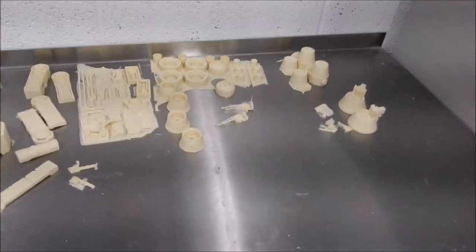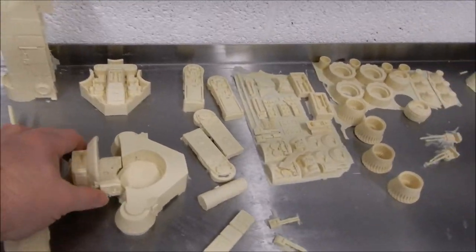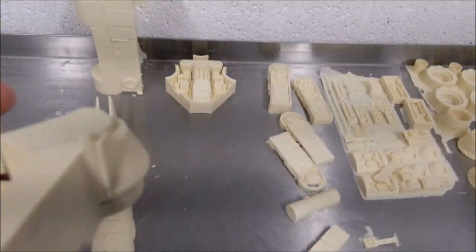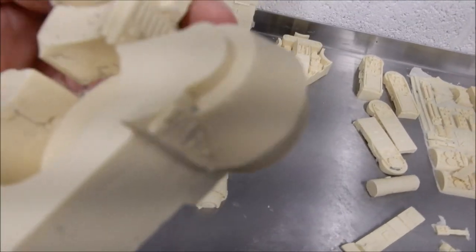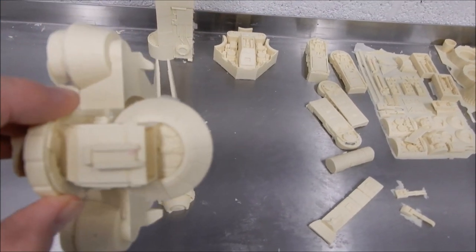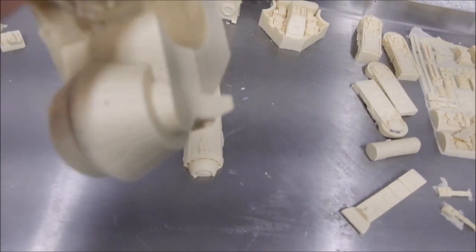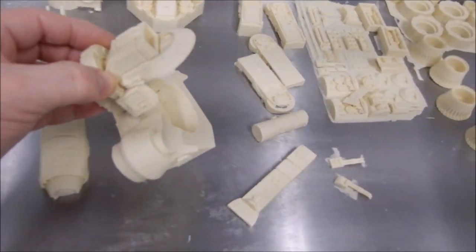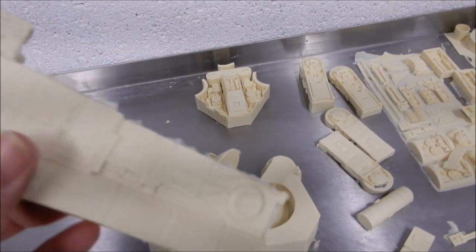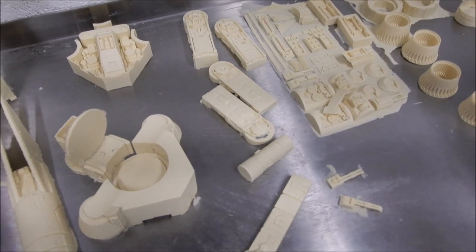Well, it doesn't look like much right now. One of the first castings of the hammerhead, and they came out pretty good. A little flashing on it as usual. These look a little dirty because what usually happens the first time you mold up the patterns and they've been primed, a little primer comes off inside the silicone. So what you get is this really nasty look of little bits of primer on the part. It doesn't affect the paint job or the resin in any way.